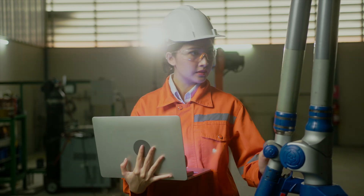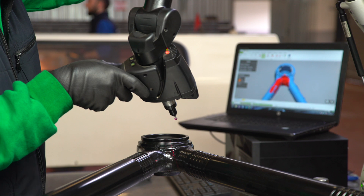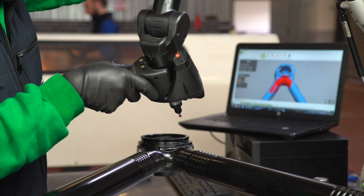When choosing these tools, you need to make absolutely sure that the tool will add value to your lab by being able to inspect the parts you're measuring. I can't stress this enough — I've seen too many instances where a manager that has never had to inspect parts for a living has purchased a piece of equipment for a lab, only to have it collect dust because it was ill-equipped to measure a specific type or size of part. One example I've personally seen is putting a portable measuring arm in a lab space inspecting consumer electronics. A tool like that makes a lot of sense for a lot of labs, but not so much in that lab.